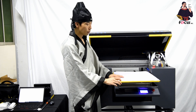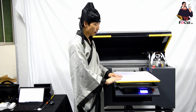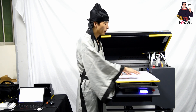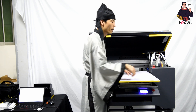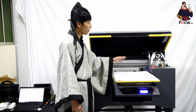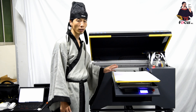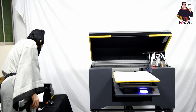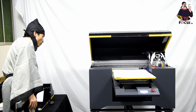We need to take the paper, put it on the top of the table, and make sure the tape will not cause bending. You can use tape to fix the paper to the table. Then do the thickness adjustment up and down to be sure the gap between the print head and paper is safe. After that, go to the software and load the paper.